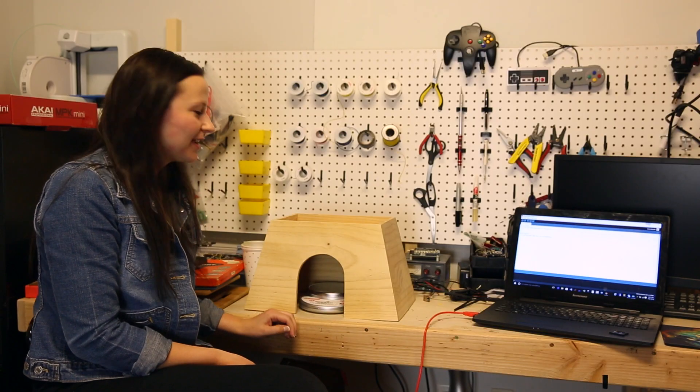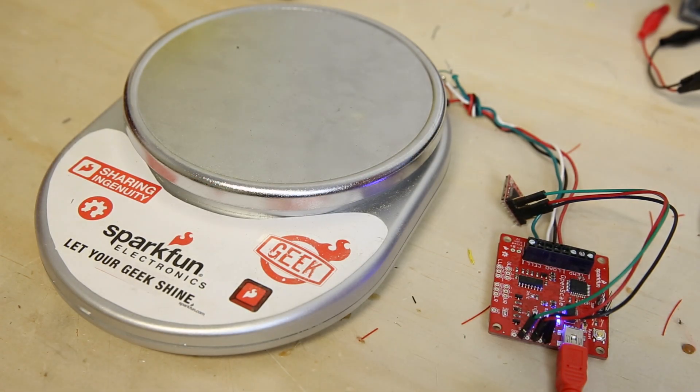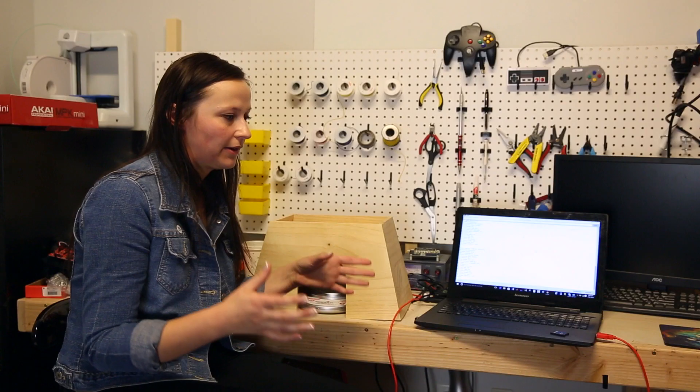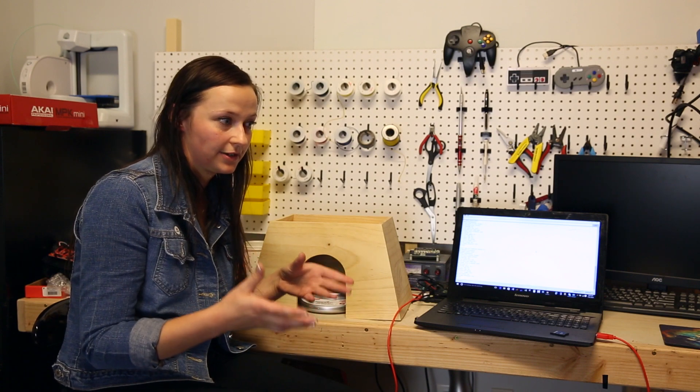Here's my project. Inside this rabbit house is a 10-kilogram load cell connected to OpenScale. Inside the rabbit hole there is gourmet rabbit food. Yesterday when I set this up in my backyard, I dug a little hole and wanted to make sure that the scale was at ground level, then I put a board on top of it. I wanted that to equal zero weight on the scale, so I needed to create that reference.